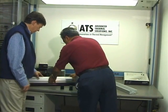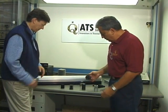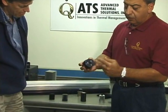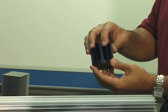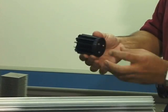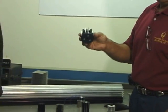They wouldn't use it at this size — you'd chop it up or cut it to different size lengths. Exactly. There are a couple of examples where the extrusion is cut to size, where the LED goes in the bottom. The heat is conducted from the base into the back and then eventually convected off. These go on LEDs that can fit inside the ceiling or onto a wall for spotlighting type applications.